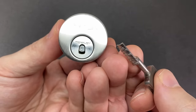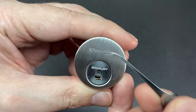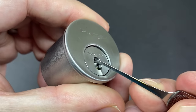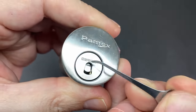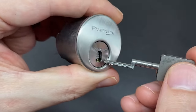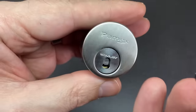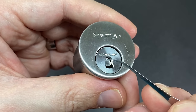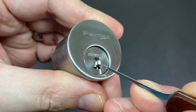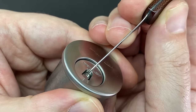What's inside is somewhat of a mystery. First, let's look at the features visible from the front as if it was installed in a door. We see the outer mortise cylinder, and the front plate of the cylinder is very nice and thick. There's a little lozenge shape which looks like it's blocking the keyway but isn't - the key is a section of a tube and slides underneath. That is the pusher, and it does two really cool jobs: it keeps the internals of the lock aligned and stops them from moving when there's no key in the lock, protruding into the front plate by about a millimeter.